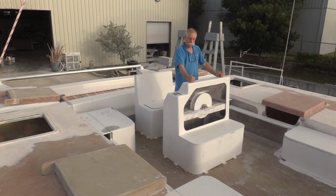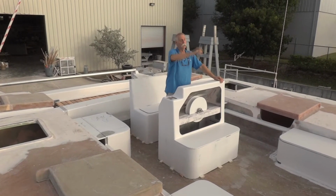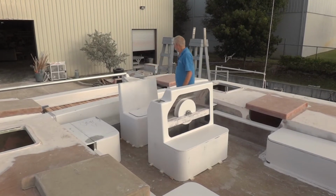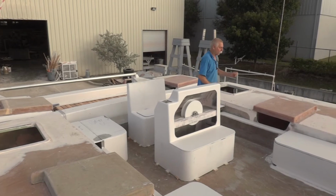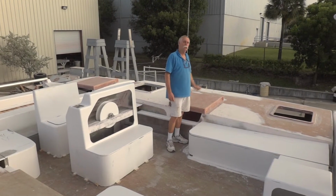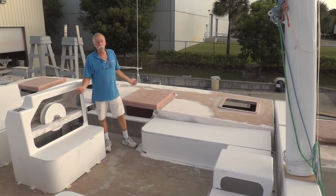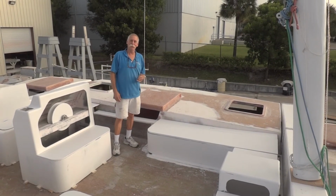There'll be 2 tubes here that go up to the Bimini. That helps us get our wiring up to the lights in the overhead of the Bimini, as well as provide more support for the center part of the Bimini. The Bimini will attach to the 2 main beams, as well as to here, as well as with a banister here outside each companionway, and one a little bit further going outboard, and then there'll be 4 angled forward. This provides a great basis for an enclosure, for screens, for curtains, for a dodger, whatever sort of canvas work might make the boat just perfect for you.